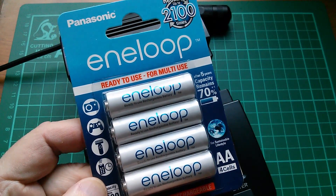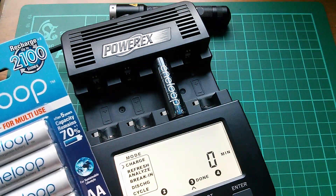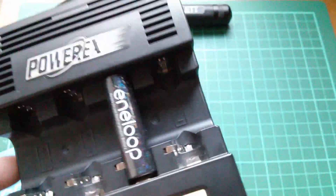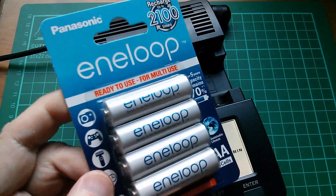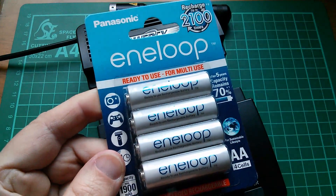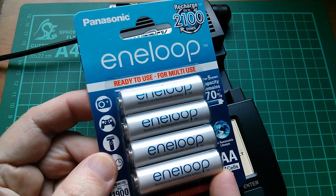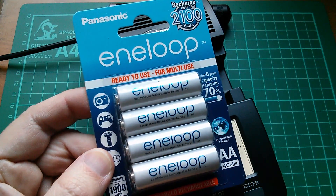I'm now going to open my brand new pack of Panasonic 4th generation Eneloops and put them in my PowerX charger — the Maha MHC 9000 Wizard 1 Charger Analyzer made by PowerX. I'm going to check the capacity straight out of the packet, because I remember on the 3rd generation they didn't have a very large capacity — only about half charged — and people came up with various theories about that. It does make a bit of a nonsense of the 'pre-charged' label if they're only half charged. Then I'll give them a full charge and discharge cycle to see what capacity they have when fully charged, and I'll put all those results in the description once the data comes in.